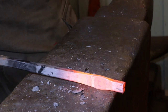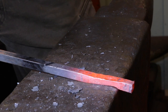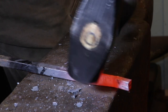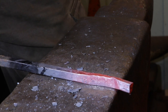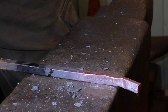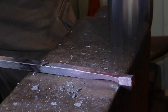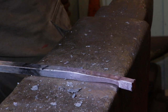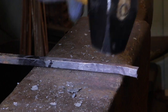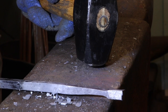The only other modification I would highly recommend is to replace the handle that comes with these hammers. These hammers usually come with a handle that is really short and tends to be very round in cross section, which makes it really hard to hang on to and almost impossible to control the angle of the hammerhead as you're forging. At the very least, modify the shape of the handle so it's more of an oval shape so that you can tell where the hammer face is at all times.